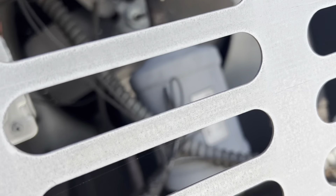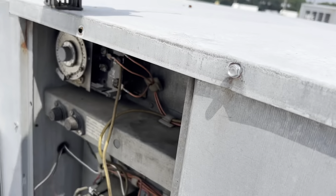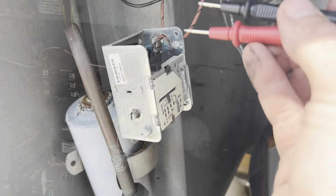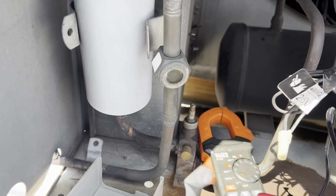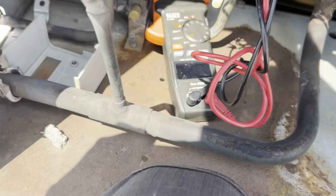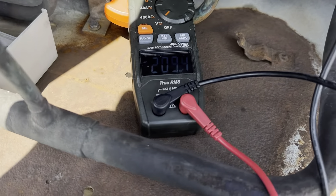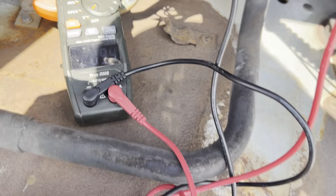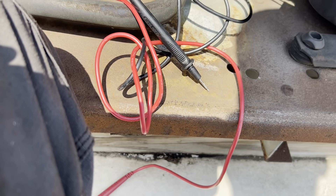But we don't even have a fan running. If you're out on low pressure you should still have a fan spinning. I need to open this up. All right, so this is your low pressure control - zero, so that's closed. And your high pressure control: 209. So we're off on high pressure.